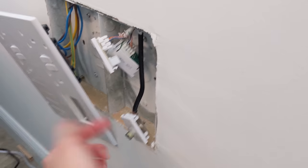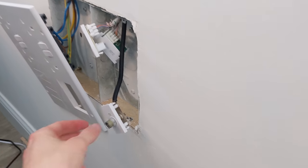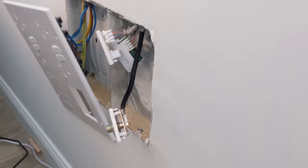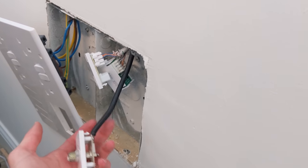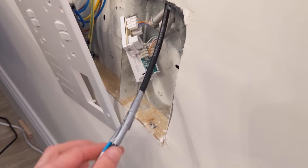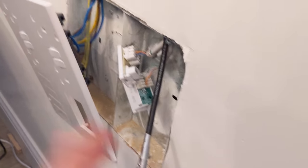My friend has pulled the cable and successfully pulled the slack up, which means it's loose enough. What we'll do now is detach this aerial connection from the faceplate, tie on some washing line, and pull it up so we get the washing line up into the attic. At that point we can tie additional network cable on, pull it up, and then pull the aerial cable back down to reinstate it. I've now taken the aerial point off and tied on the drawstring - hopefully that's secure enough. I'm just hoping the holes the cable goes through in the wall are big enough to take both the aerial cable and the Cat6 alongside, otherwise I'll have to cut into the wall to widen them.